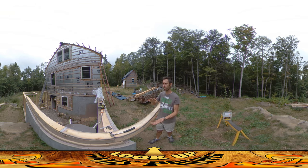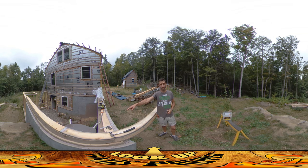Under the house is all this gravel that was put in as a base. If you have a radon problem, having gravel where air can move through it actually makes it easier to install a radon mitigation system. But the biting irony here is that the gravel that was brought in — the gravel you can see right down here — is incredibly rich in radon. I took some of it, put it in a jar with the radon detector, and after three days the levels were 20 times higher than what's considered safe.